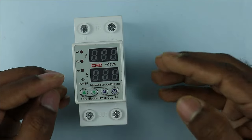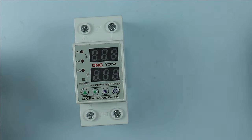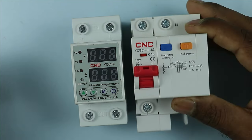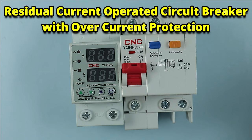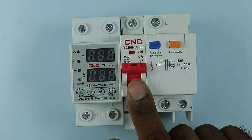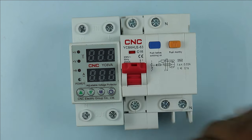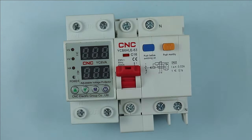The first fault that occurs in your home is overcurrent. Besides, if you want that nobody encounters an electric shock, then you can use this type of protection device. This protection device is known as RCBO — Residual Current Operated Circuit Breaker with Overcurrent Protection. This device will provide protection from earth fault, and you can see an MCB combined with it. So this device provides earth fault, overcurrent, as well as short circuit protection. Overall, you have to use these two devices, and after using them, you will get complete protection from all electrical faults.